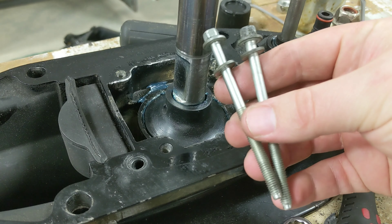I'm back to the main seal now. The first thing you want to do with the water pump is grab two bolts that fit in these holes — same thread count — fairly long. These were actually a coil screw or intake manifold screw from another automotive application. I cut the heads off and rounded them off with the grinder to use as alignment pins.